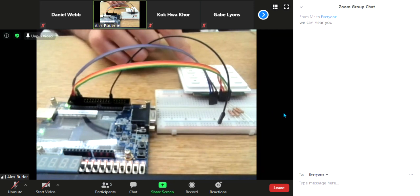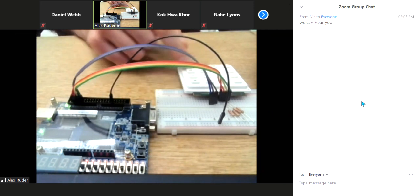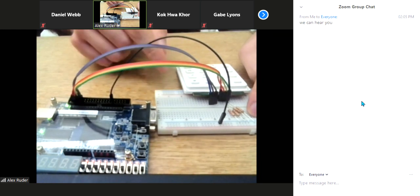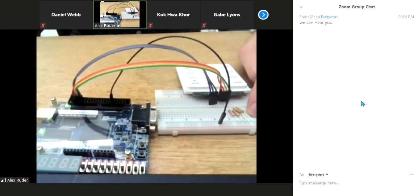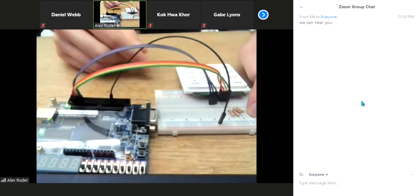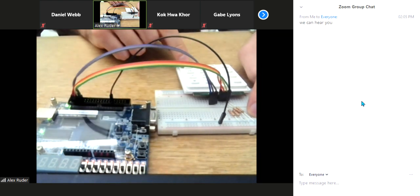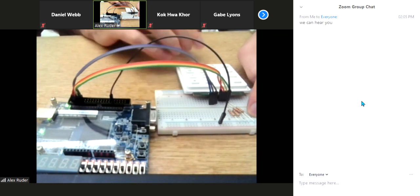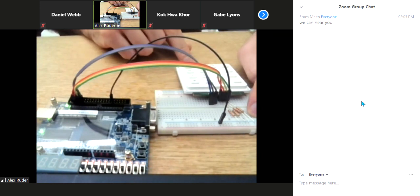And that would happen if I press one of the buttons on here, that would make a connection, which is why we need these pull down resistors on those row pins so that they're not just floating there, so that it has a defined state when no buttons have been pressed. Then once I actually press one of the buttons in that initial state, it realizes that a button has been pressed somewhere on the keypad. It doesn't actually know where, and then it goes into the next states to find that out.